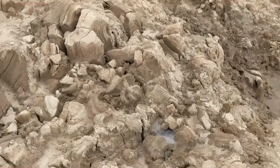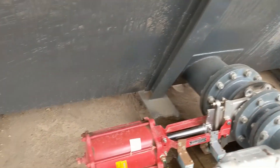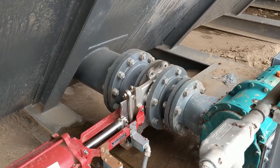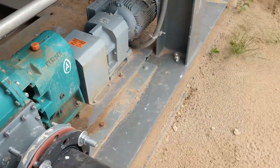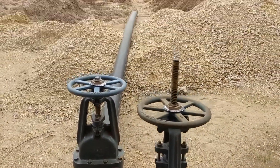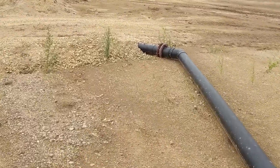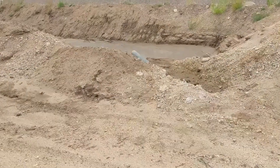Here's a look at the mud removal system. In this clarifier, centered on the tank, the screw is going to pull the settled material to the central location. We've got a pneumatic knife gate and a mud pump coming out to a tee with two gate valves that allow the settled material to flow to either mud cell. We've designed these mud cells with enough volume to last for at least four weeks, so we're getting a lot of storage and dewatering before we have to flip-flop back and forth.